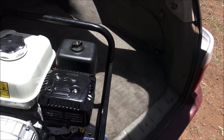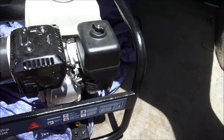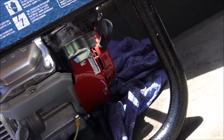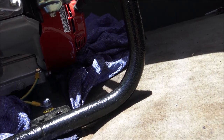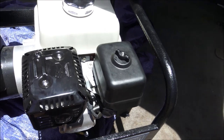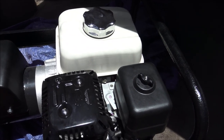The inverter technology I think is somewhere in this area, and it's got plenty of air around it. The other thing is, with this generator it's easier to service. You've got the air filter here, and going around the other side there's a fuel bowl which you can take out to keep your fuel clean before it goes up to the carburettor, oil fill, and that sort of thing. The main thing is that this has better airflow around it to keep the engine temperature and components much, much cooler than the previous one I showed you.